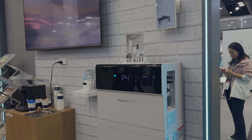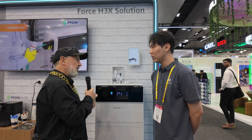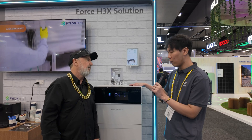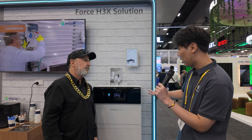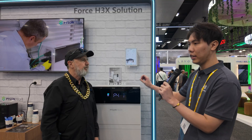Yes. Now you said it's 5 kilowatt hours per battery module up to 20 — what if I wanted 40? Can I have parallel systems? Yes, for the single-phase inverter, this all-in-one solution, we can parallel another stack and we just need an RJ45 communication port for them to communicate with each other. So two inverters together gives us 40 kilowatt hours of battery storage capacity.